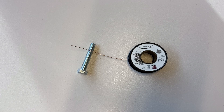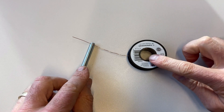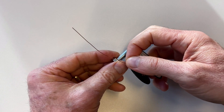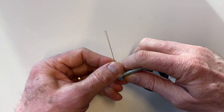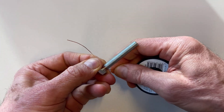The first step is to prepare our materials and I'm going to start by making one of the electromagnets. I have a bolt here and my coated copper wire — my insulated wire — and I'm simply going to wrap that wire around this bolt. I'm going to leave a tail of about two or three inches. These bolts are nice because they have threads and I can wrap the wire right in the threads.